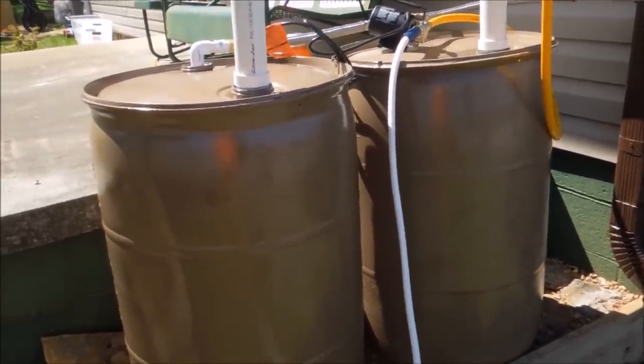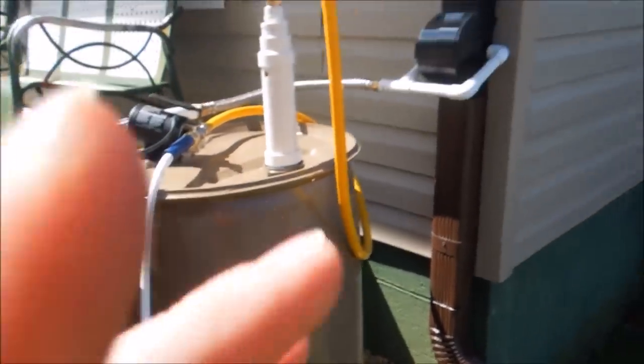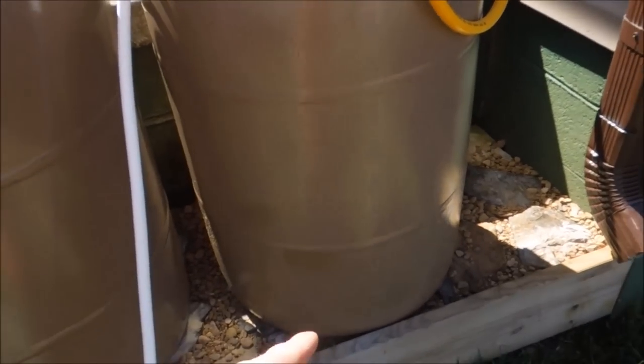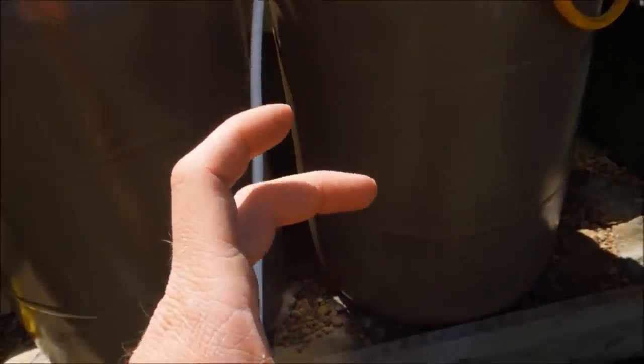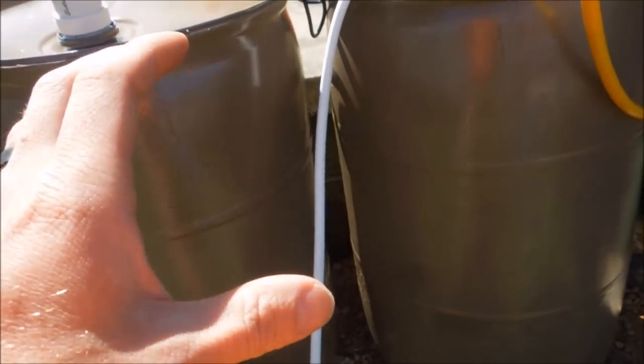I am confident they will be fine for our purposes — we're going to be using them for garden water as well as animal water. And if we've got enough, we can wash the cars or do whatever. So: barrels, diverter, and your plumbing. Since the lid is fixed, I couldn't get inside the barrel to put in the rubber gasketed grommets to connect them. I wanted to run them in a pair so when one fills up, they both fill up simultaneously, and when you drain them, they both drain simultaneously. Unfortunately I couldn't do that, so everything runs from the top.